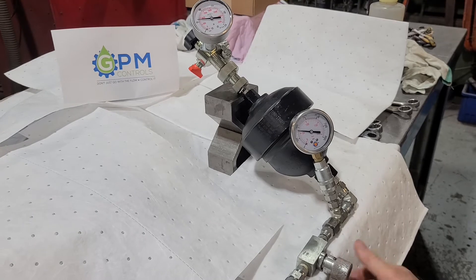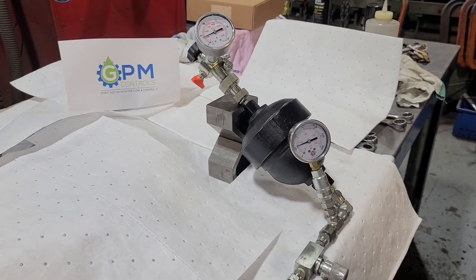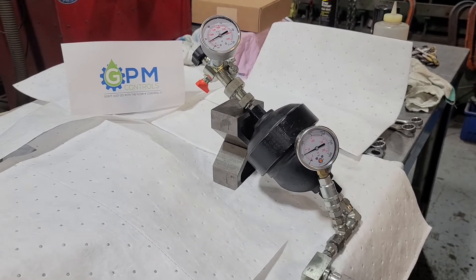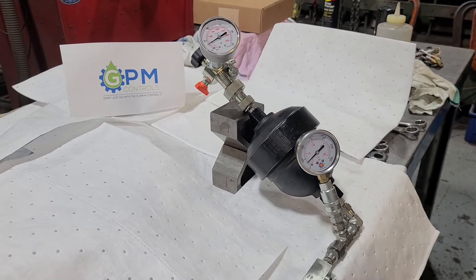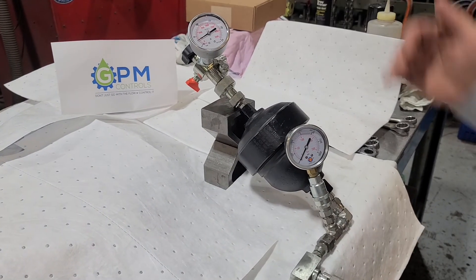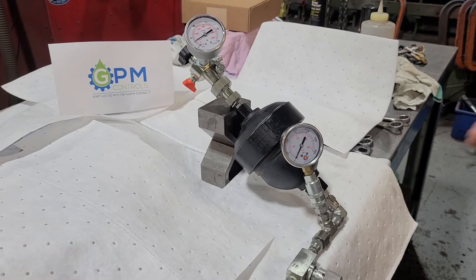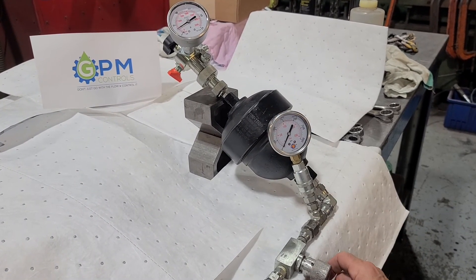I open the needle valve, you can see both gauges, both needles are dropping. But at a certain point, once our pre-charge is reached — click — we see a quick drop in the needle, and down to zero. Our pre-charge remains at 500. We know from that experiment that our pre-charge is right around 500 psi.